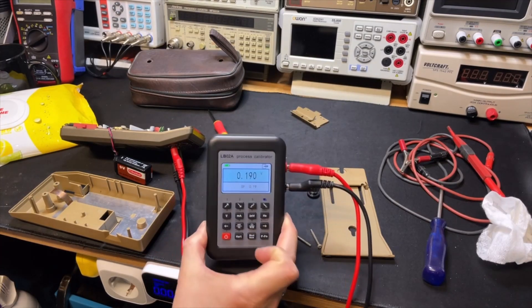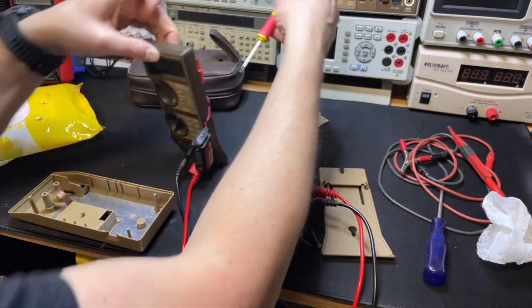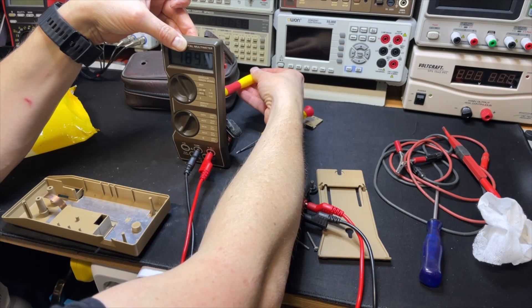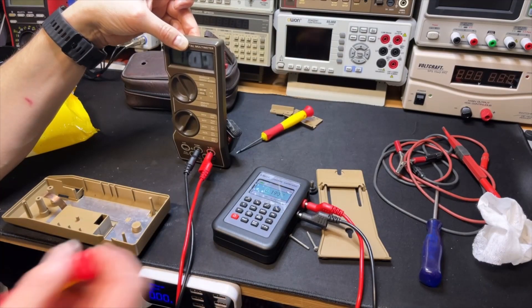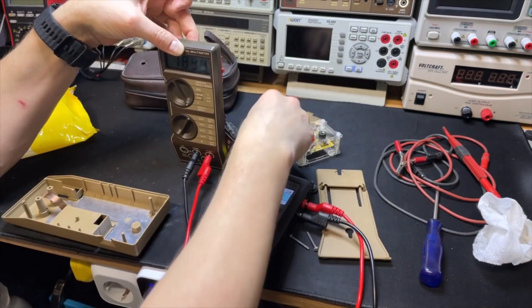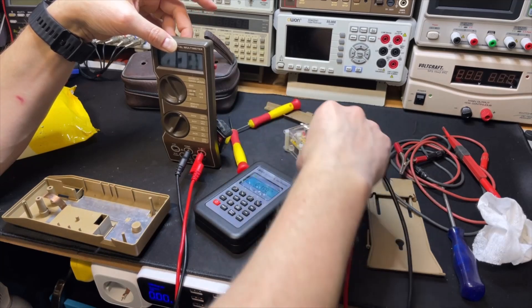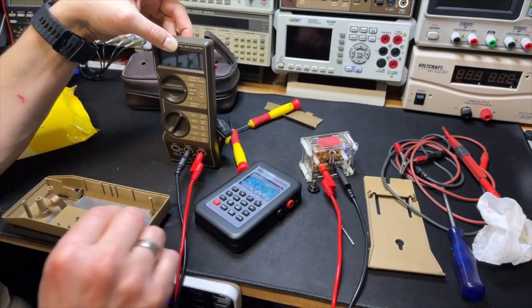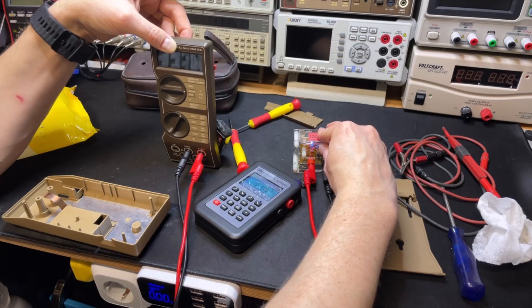Okay, I'm now trying to calibrate it. It is at 190 millivolts. I need to push the display and look at the screen but also adjust. It is 190. Let's see if it also agrees with this one. The zebra strip - I need to push it because usually the case is doing that. So this should be 2.5 volts. Yeah - 2.5, perfect. 5 volts. 7.5. And 10.